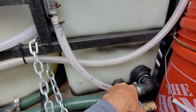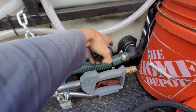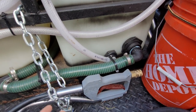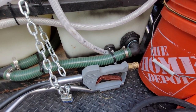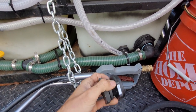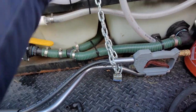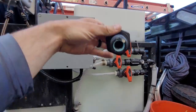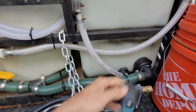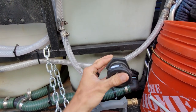This is what you call a bulkhead — this is what one looks like. Basically, you drill a hole in the bottom of the tank. This one here is three-quarter, this one is an inch and a half. You can do half inch or even bigger. For a 12-volt system you're going to want either half inch or three-quarter. You drill your hole the size of the stem, then from the inside of the tank you reach in from the top, go all the way down, and poke this through the hole. You have a seal that presses up against the back of the tank.